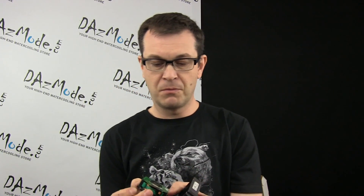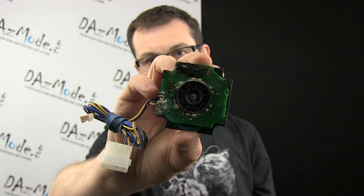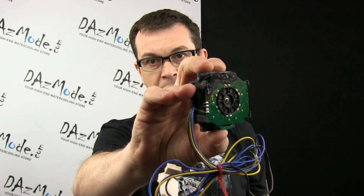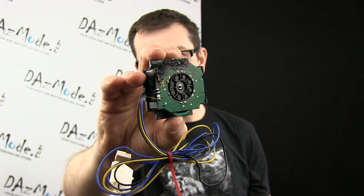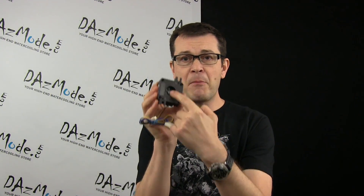The other pump is an actual failure due to overheating. You can tell what happened by looking inside at the PCB. One pump is burnt but also has white oxidation marks from liquid — the whole thing is corroded and burnt out. The other one smells really bad but has an absolutely clean PCB board — it definitely burned out from overheating. Part of the problem is attributed to anti-vibration pads supplied by Swiftech, which is basically a piece of foam attached to the bottom of the pump that makes the pump cook itself, literally. That's not a good idea, and it has definitely contributed to pump failures over the years.